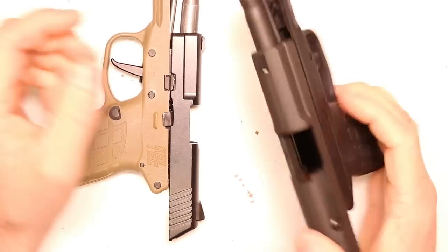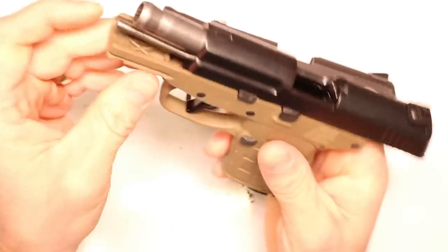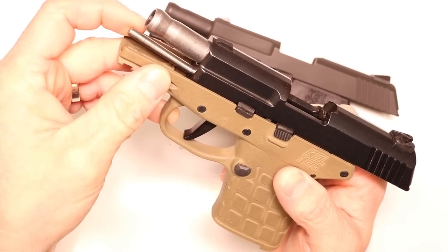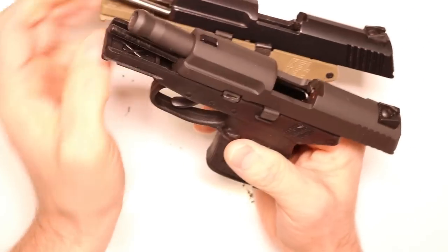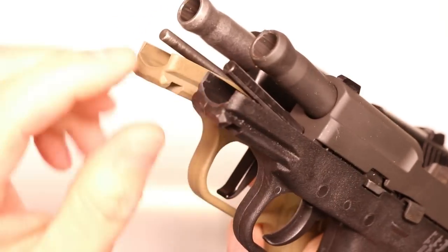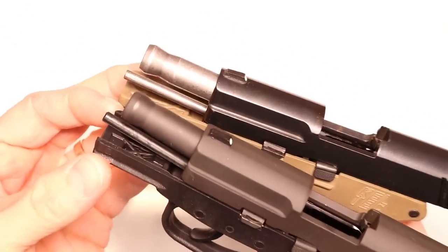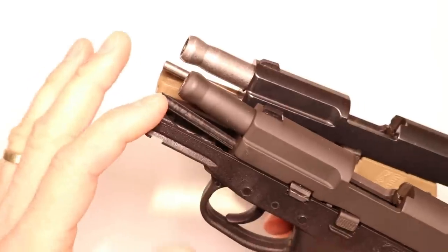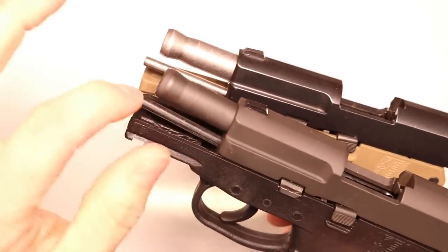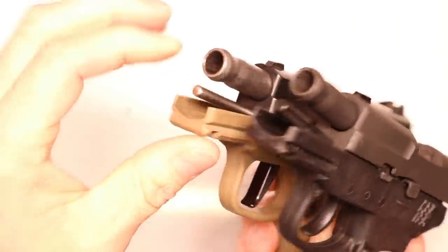Some of the things you'll notice right off the bat — this is a plastic guide rod on the factory PF9, and we've replaced it with a stainless steel guide rod. The stainless steel guide rod is the way to go. It's going to last much longer than the plastic guide rod, and it's not going to grab that recoil spring. You can even see there's a seam line on the plastic guide rod. The stainless steel guide rod — 316 stainless — is going to last a lifetime. It's a good insurance policy against malfunction, since plastic can bend and warp over time and easily induce a malfunction. That recoil spring sliding on it is going to grab, drag, and cut into it. Not going to happen with the stainless steel guide rod — just the way to go.